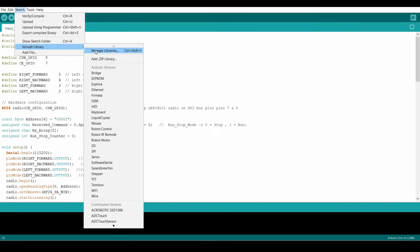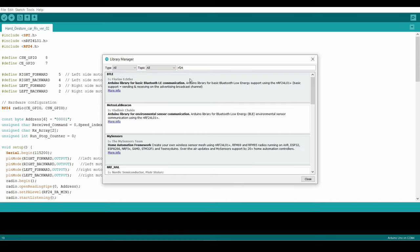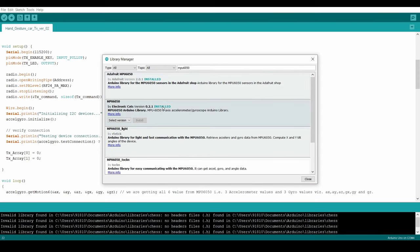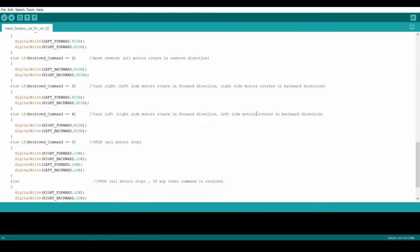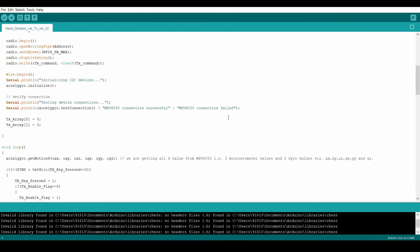Before uploading the code, install the nRF24 module library from the Manage Libraries menu. Similarly, install libraries required for the MPU6050 accelerometer. The link for the receiver and transmitter code is in the description below. To understand the code, feel free to take the help of the comments.